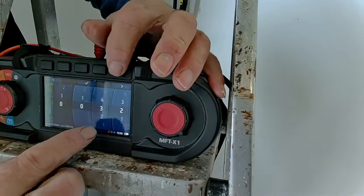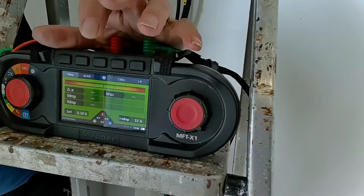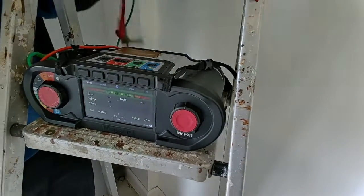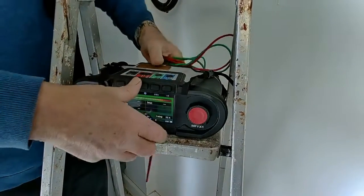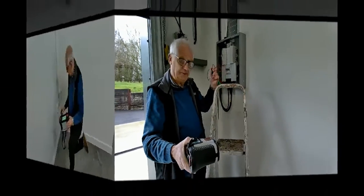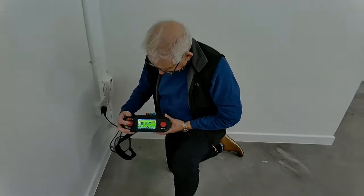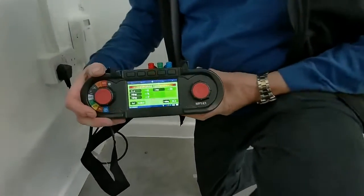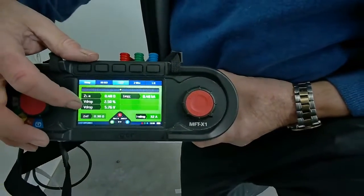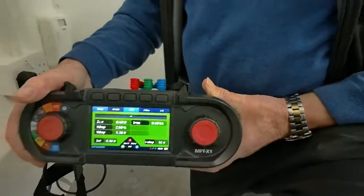I can move across — you can see that it's set at 32 amps, which is fine. I'll now press and I'm ready to go. So what I'll need to do now is just swap these leads for a plug and lead set, and go across to the socket outlet, plug it in and we should find out what the volt drop is for this circuit. I can plug it in, switch it on, push the button and take a reading. And it should give me my volt drop, which is telling me that it's 2.5%, 5.76 volts, which is perfectly acceptable for this circuit. Thank you.